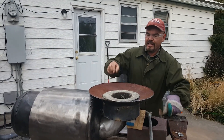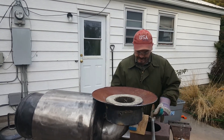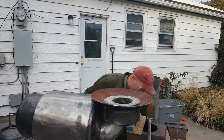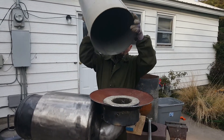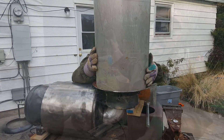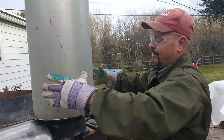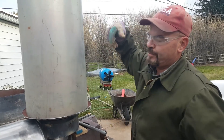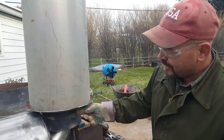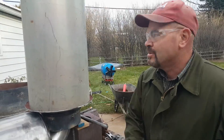I'm going to make another ring out of steel and put it in here that'll fit on the inside of this tank. After the heat riser goes on, this will go over the top of the heat riser and set right like that. She can put on a great big ring over this and fill it with pea gravel for mass. I know she's going to run the exhaust out of here down through a bench.